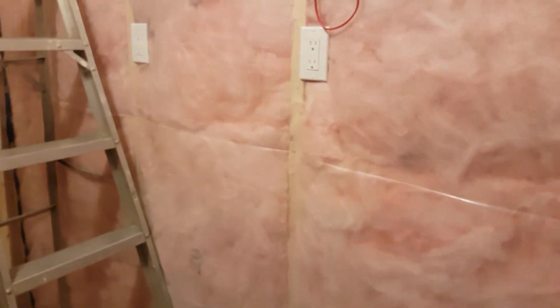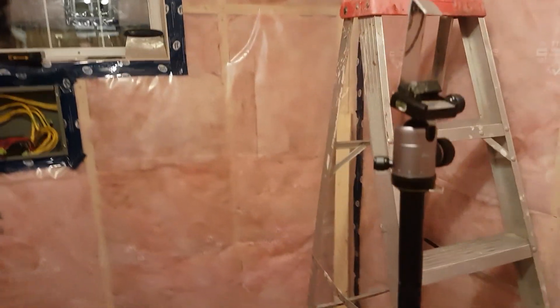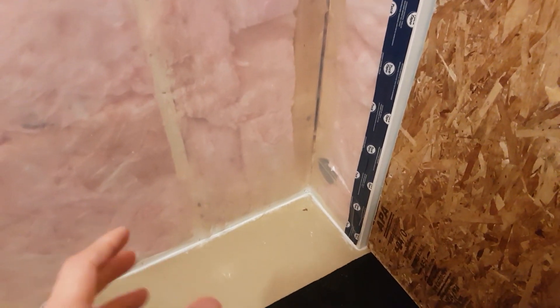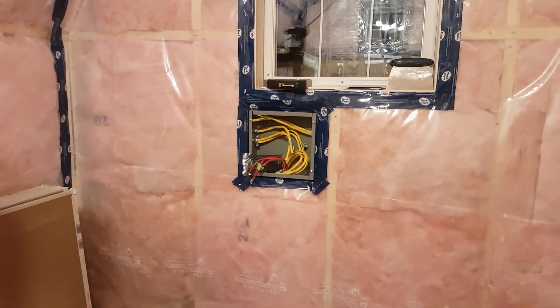We wired up two banks of outlets in this place, one on each side — they're behind the drywall — about three outlets on each side, plus some on the ceiling for lights and stuff. We've also been working a lot on ventilation. There's a ventilation unit down there where I have to cut a hole in the vapor barrier, put in the other end and filter material, which will also prevent drafts and air leakage. And up there, the ventilation fan is installed.